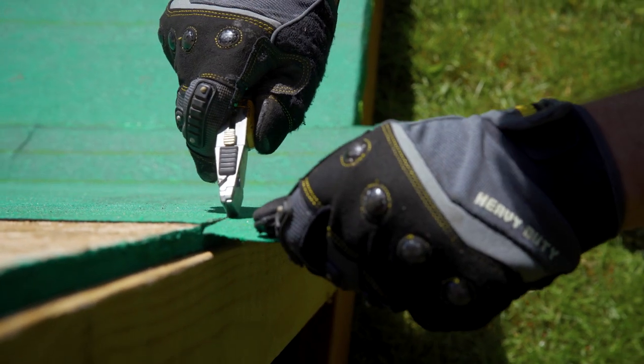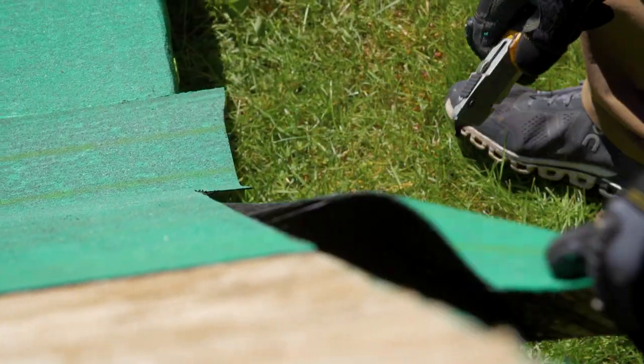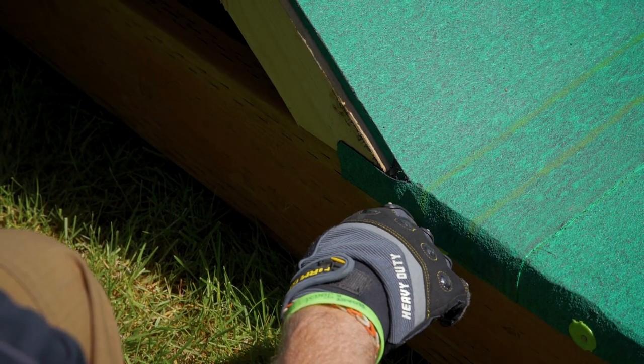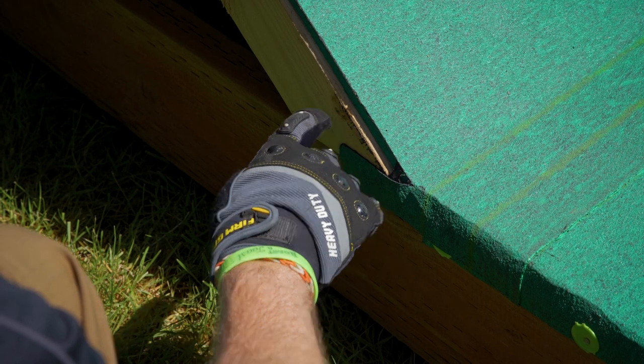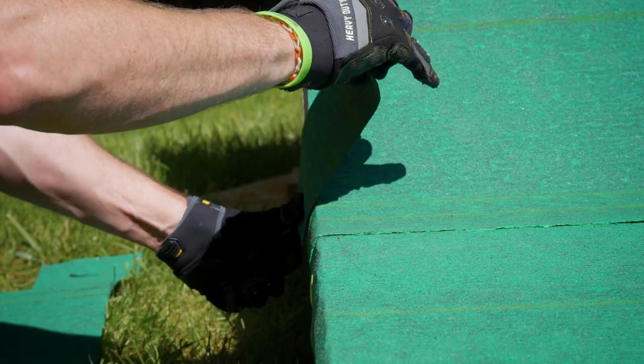At the rake edge of the roof, we can trim right against the edge of the roof. At the edge of our transition, I made a four-inch strip that proceeded into the rake position. I will also put a patch piece in this location to help make that transition watertight.